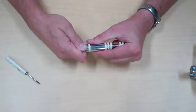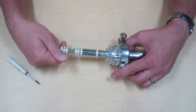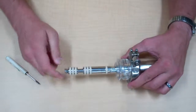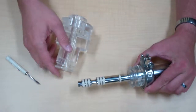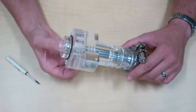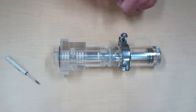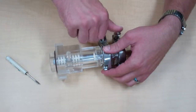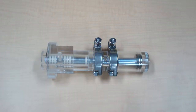You've successfully reassembled the plunger. We will then reassemble it to the piston rod of the sampler. You can check your assembly drawing to verify the torque, and use wrenches to tighten it. You can then reinsert into the body — you would use the moly coat, Krytox, or a process-acceptable lubricant. Reinstall your tri-clamp, and you are ready to put the sampler back into service.